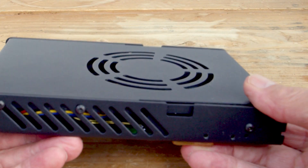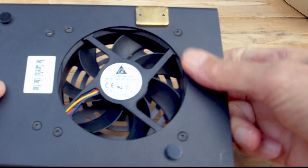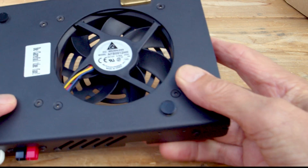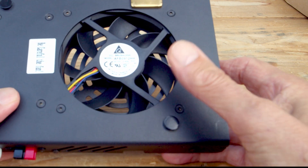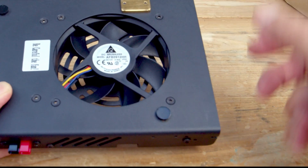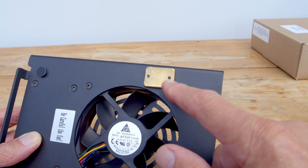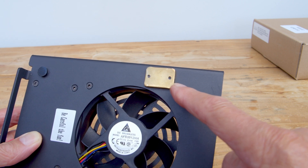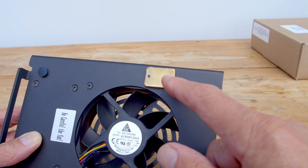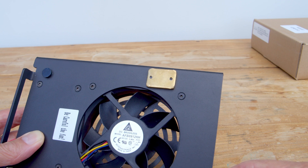You've also got some mini PowerPole connectors, which I haven't seen before, but they are there. Turning it around the other way, you'll see another vent. The unit draws 150 milliamps. Underneath, we've got the fan unit itself — this mates closely up to the bottom of your G90. This fan extracts air from the heat sink of the G90 and exhausts it through the vents either side. There is a temperature sensor underneath, because the fan has two speeds.